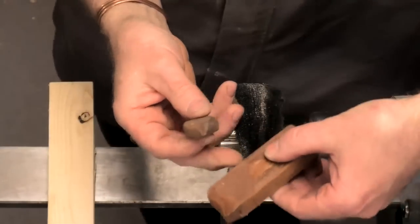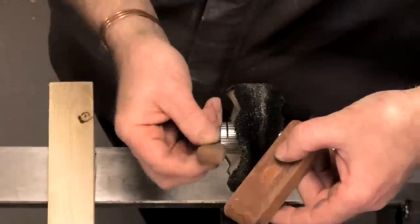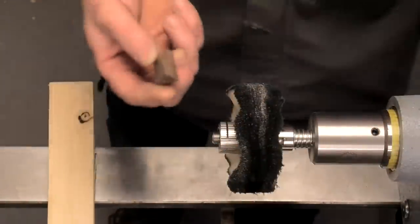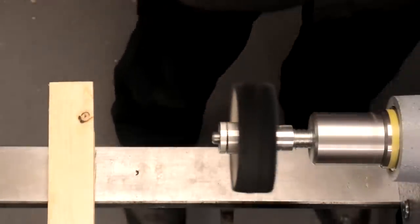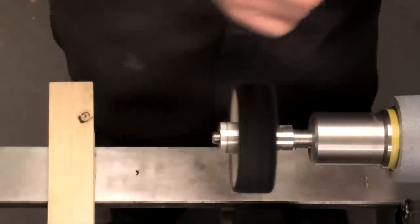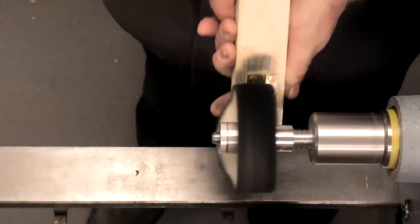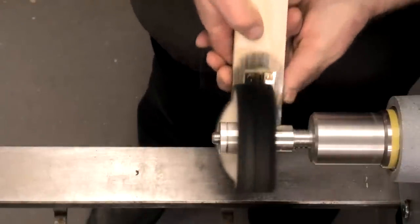Right. On the brown compound, this is exactly the same as what we polished the wood with. But I'm using a different mop because I don't want to put the black residue that we're going to get off this mop onto that one, okay? I say it'll go black. So polishing steel on a mop will make this go black. Or polishing brass, shall we say, okay?